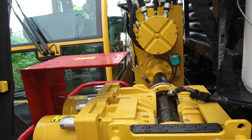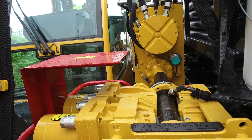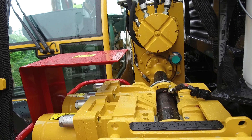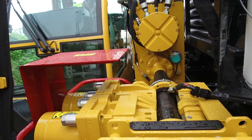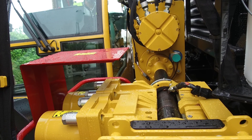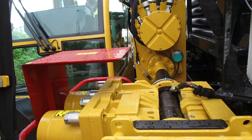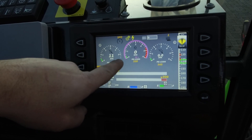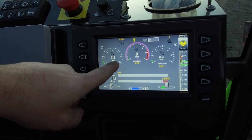Start rotating the sub saver clockwise and move forward to connect to the drill string. Start with low rotation around 20 rpm. In the middle you can speed up again, but close the connection with lower rpm. You need to achieve the maximum pressure to open the front vise. In dual rod mode, the outer rotation speed and the inner rotation speed can be set separately.